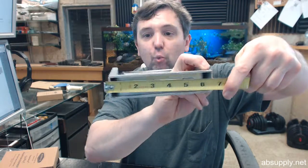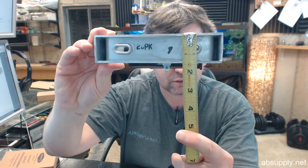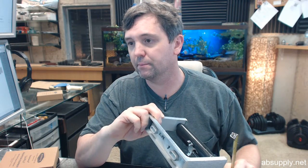Now, let me give you some dimensional properties. By the way, speaking of dimensional properties, it holds up to a 6-inch roll. There is a link below this video to a document called Product Brochure, which is very handy because it will start with the dimensional properties. 6.5-inch wide. This is, yeah, about 6.5. The height, they have this at 1.5 inches. It's closer to about 1 7/16. Projection of the arm is 4 7/8. Then, of course, your spindle and your roll diameter will push it out to about 7 7/8 with a full roll.